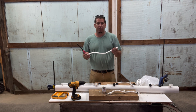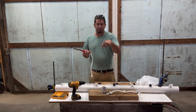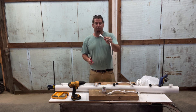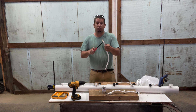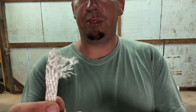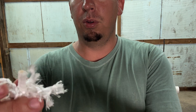Now we need to go back and put our poly rope in. This is half-inch poly rope. I'm cutting every 18 inches, leaving two or three inches of rope down inside the pipe — so make sure it's not cut off too short. As you're cutting this it starts trying to fray on you, so just take a lighter and burn it back down. You don't want your rope coming to pieces, and you also need to get that compression fitting over top of it — with loose fraying it would just go everywhere. This poly rope has a wick in the middle of it. You need to use a razor blade to cut it, and you can see the little wick inside there — that's what's going to be taking the chemical and moving it through.